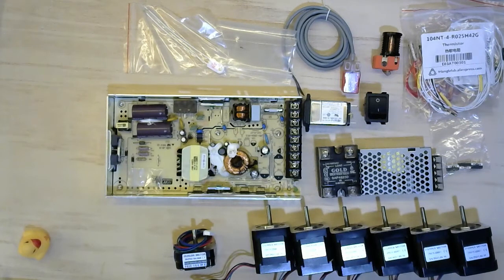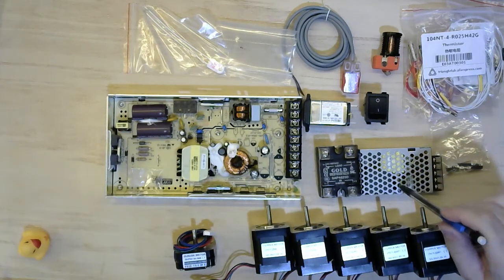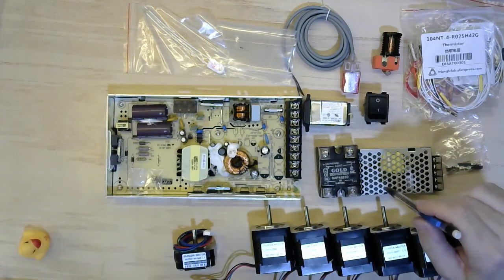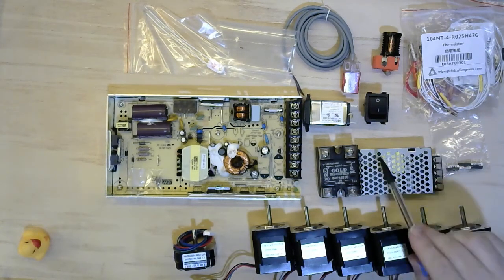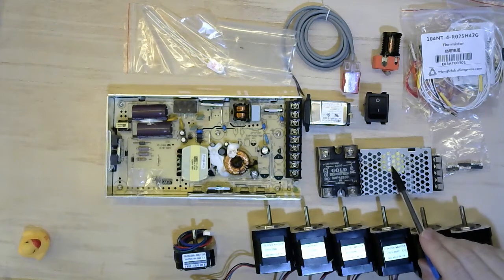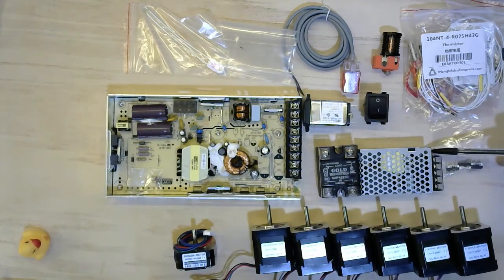Shiny. Here is a Meanwell 25W 5V power supply — no go-bang switch this time. Similar idea as before: AC here, safety capacitors here, DC choke and noise filter, 327V DC here and a 400V capacitor, flyback here, actives here and here, 5V DC here and adjustment here. Again, set this to below 5.2V before attaching a Pi, to avoid having a bad day.